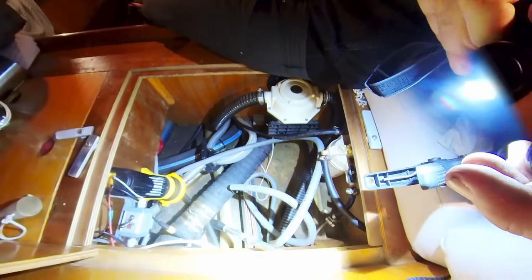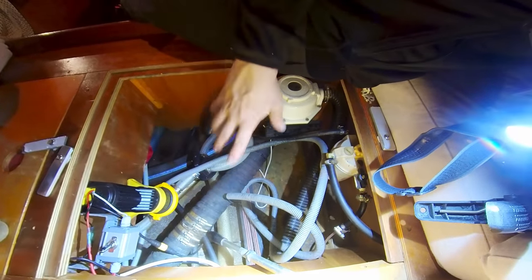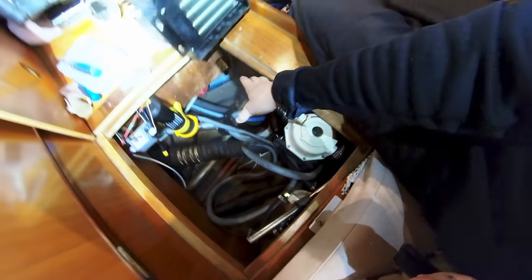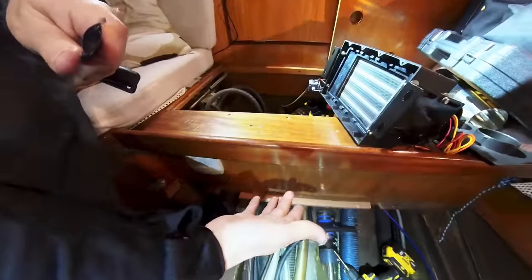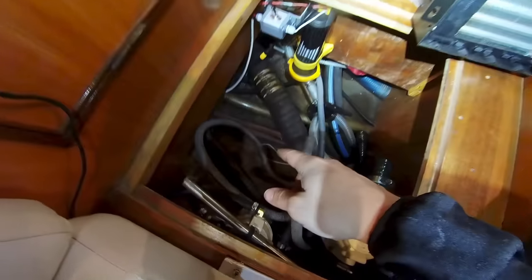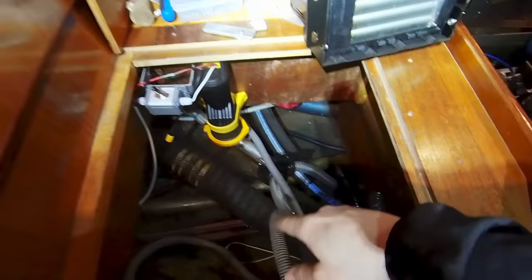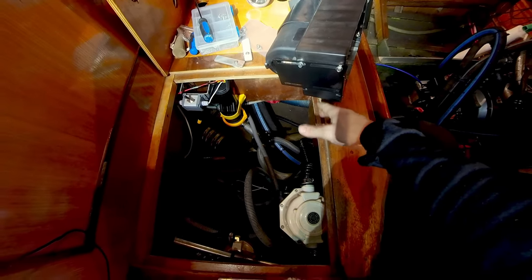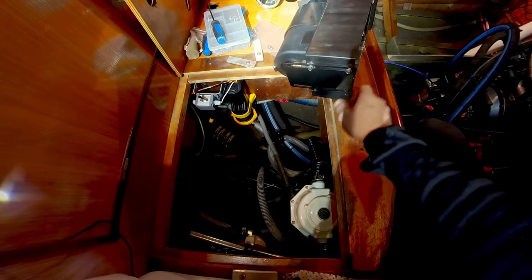So this is where I'm going to be putting the heater, and this might look like a mess to some of you, but I just call it the technical section of the boat, you know. The heater itself is gonna be bolted into this wall here, and then it's gonna blow air through into this space. We need to make a few holes on this side, and yeah, those two over there with the orange stripes, those hoses are the coolant hoses, and they go to the water heater, which is back there. Should be pretty simple. I did have to modify the mounting arrangement for this a little bit, because I didn't realize that it's supposed to be mounted on the floor and not on a bulkhead. So I changed the mounting arrangement a little bit and now it should be fine.